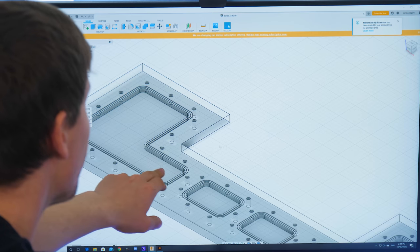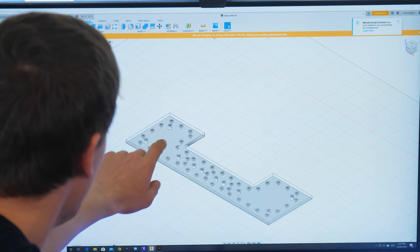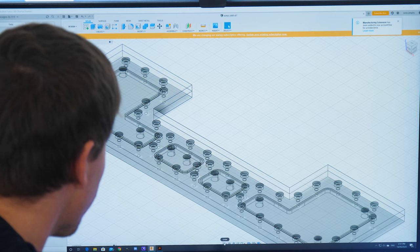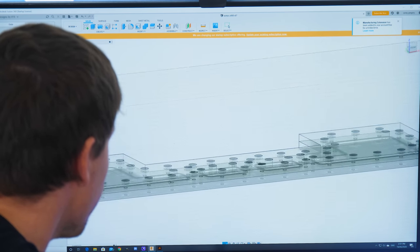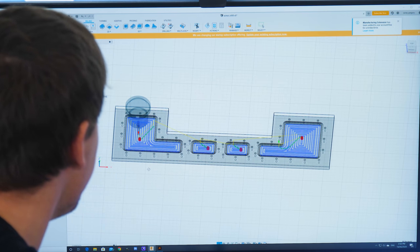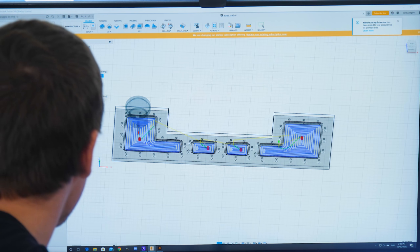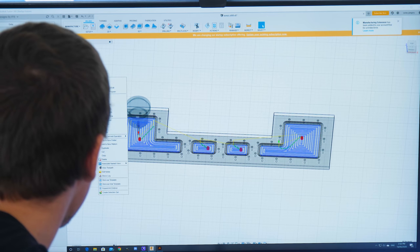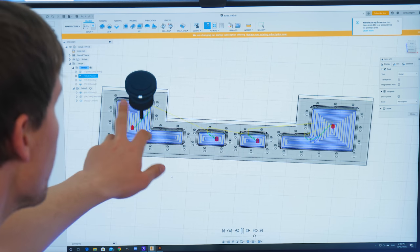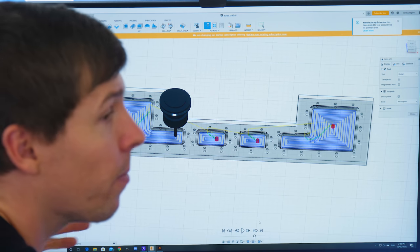Once I've done that, I can route out my channels and put the screw holes in and the O-ring groove and create different bodies. This is the bottom body, and then the top body is where the screw holes go and where we put our ports in the plate. If I turn both bodies on, you guys can see we have a 3D object representing a distro plate. Going into the manufacturer screen, I have my tool pathing all set up and I can simulate that to make sure the tool is going in the right direction with no mistakes. If I right-click and go to simulate and press play, you can see it acts like the CNC machine moving just like it would in real life. Once all contours are set up with the pathing, I can export the g-code ready for my CNC to cut out.